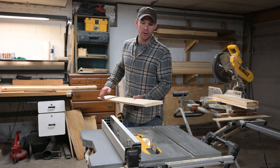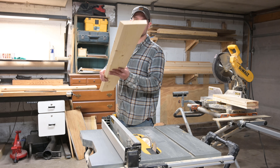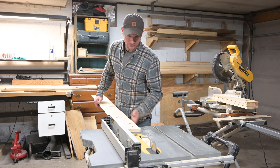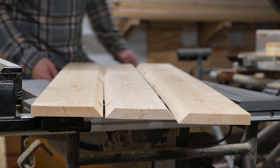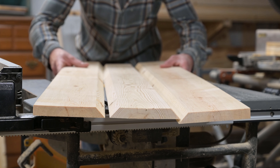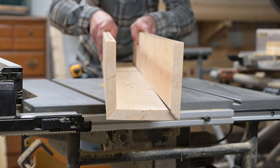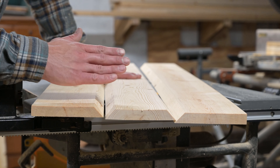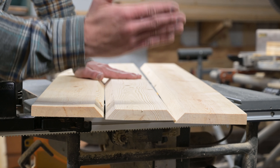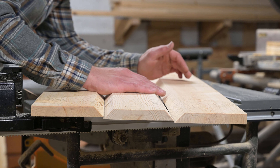For your front board you'll want to adjust your fence a little bit — you've got to make two miters, one on each side. Now that those are cut, they're gonna get glued and nailed together for a seamless bond. We also have to cut the end caps, so we cut 45s there too, and this is where you cut it down to your final length — 48 inches.